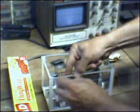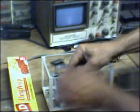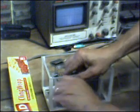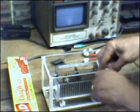Later, I'm going to be building a 200 millivolt, 200 amp DC shunt for my digital multimeter so that I can monitor current and only drop a maximum of 200 millivolts going to it, should I happen to draw 200 amps. If I'm drawing roughly 5 to 10 amps, I will only be dropping 5 to 10 millivolts between the battery and the electrodes inside the chamber.